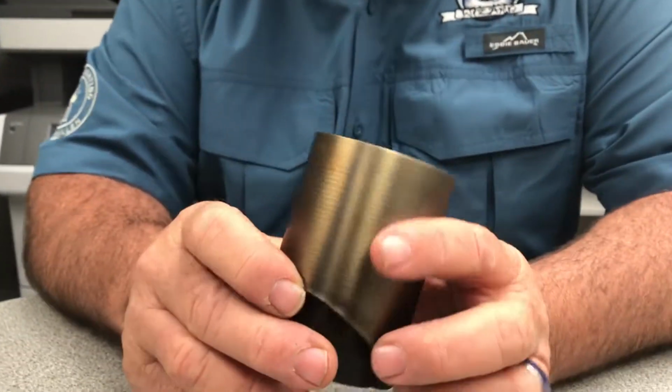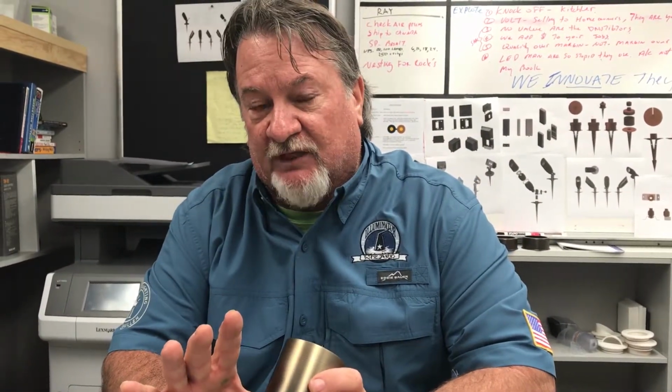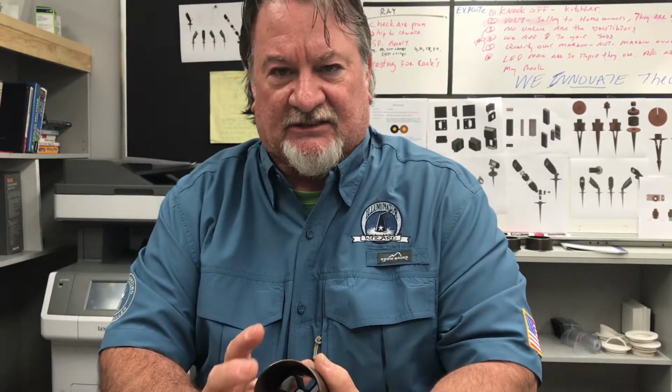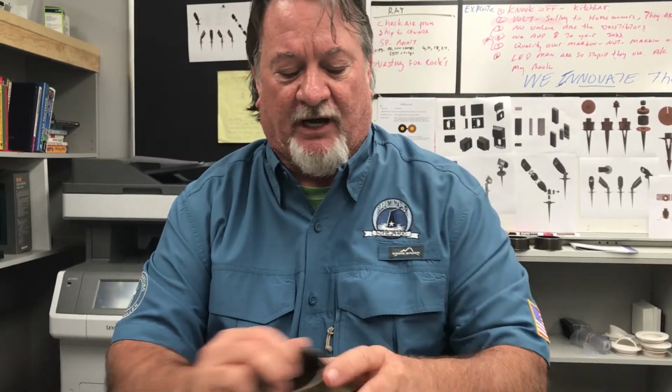Now when I took everything apart right here, you probably noticed that I popped the lens off. This is, I think, the first fixture that has a removable lens. So if any of us have ever gone back and done maintenance, we know that there's calcium deposits, dirt, grime, grease, and it's really difficult to clean a lens on site. Now you'll just have a couple extra lenses, however many you need. You pop the old lens out, pop a new lens in. It also then allows you to change the hex louver like I just did. Now the hex louvers come in from the bottom.